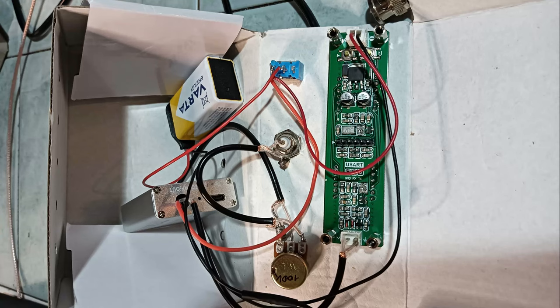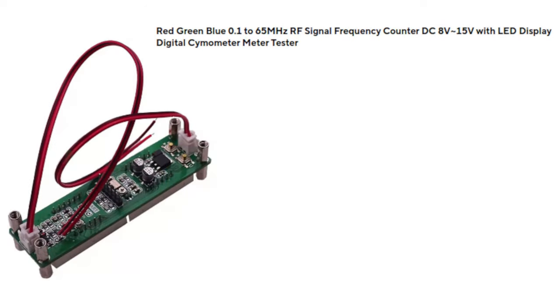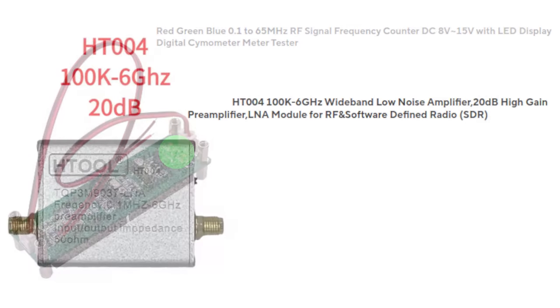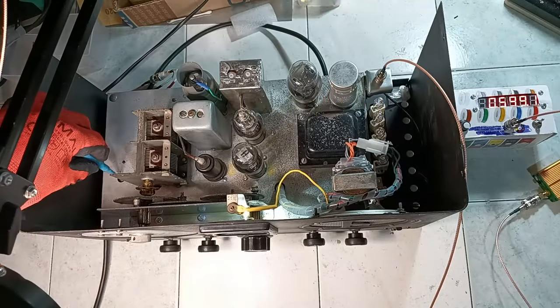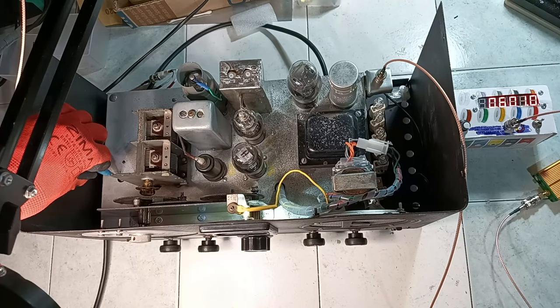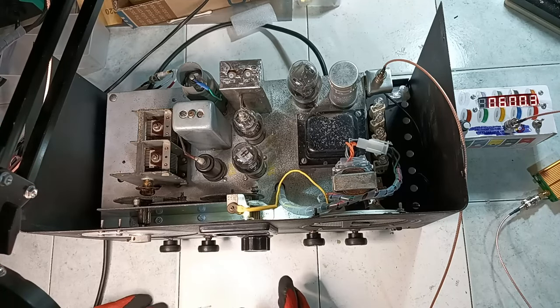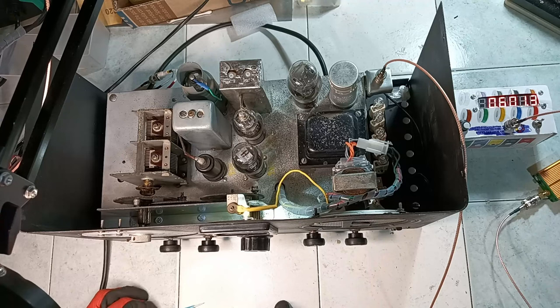At this point, a frequency counter prototype was made using an old cardboard box, putting inside a cheap frequency counter with programmable IF value and an antenna preamplifier. When that was operational, it was immediately possible to revise the RF dial alignment in a much more comfortable and effective way. The usual peaking with the signal generator was necessary only for adjusting the antenna trimmer capacitors.